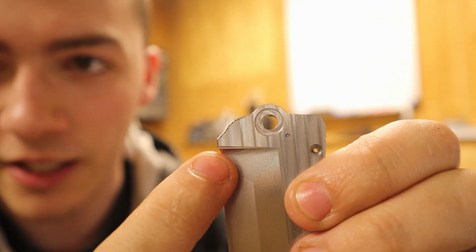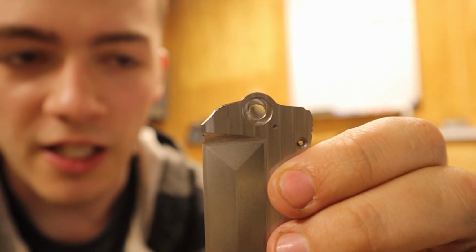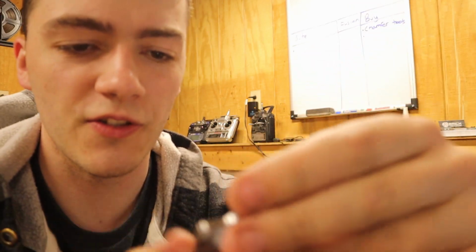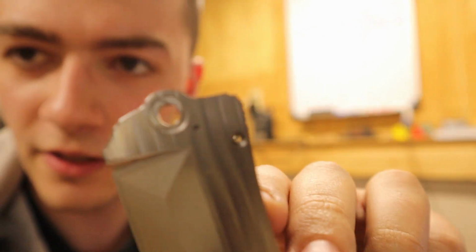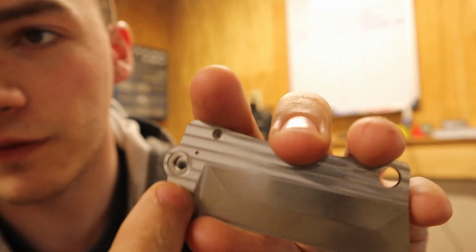And then, see right here, in this little gullet, whatever you want to call it, the ball end mill cut up here for some reason. And it's not a simulation thing, it's not a software thing, it's something to do with the way the fixture is set. So, yeah, I don't know. Sorry, my wrist is itchy. It's super weird too, because this bore right here lines up, best I can tell. And this, what do you call it, the pocket for the washer seems to line up too. So, yeah, I don't know. Kind of weird. Might have something to do with my weird height thing.